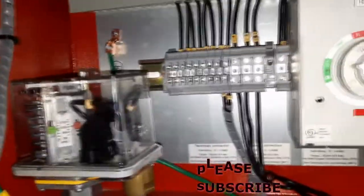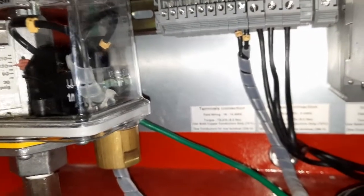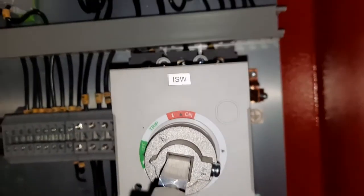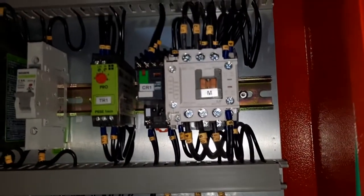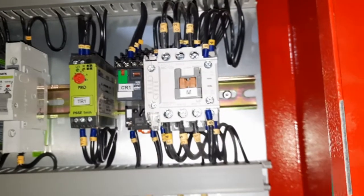In the down left corner you can see the pressure switch warning, and the pressure cut-out is set to 150 PSI. If the pressure in the system increases above 150 PSI, the pressure switch sends a signal to the magnetic contactor controlling circuit, the magnetic contactor will turn off, and the jockey pump will shut off.